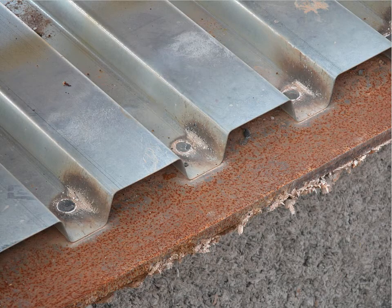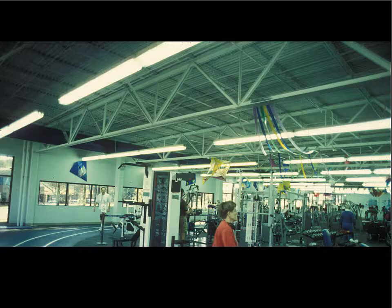Another one is corrugated decking, where this horizontal element right here connects to this vertical sheet, which connects to a horizontal, which connects to a roughly vertical sheet. And everywhere those thin sheets of metal intersect with each other, they brace each other mutually. Now, this was all made out of a flat sheet, and it was rolled or deformed into this shape. So there was no necessity for welding or making connections along this line. But every one of these connections there and along here and so forth, is a location of high stability where two mutually bracing sheets of material are intersecting.